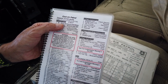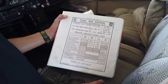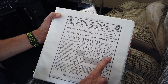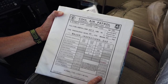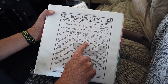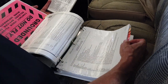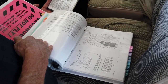AIF — the airplane information file — review and inspect for airworthiness. That's this big book. No matter where you fly, there's going to be a book that shows the maintenance status of the airplane. These are the required inspections, the dates when they were done, the hours, and when it's next due. This airplane is good — it's the end of July 2020 and nothing is coming due for quite a while. There's a 100-hour inspection and a mid-cycle oil change at the 50-hour point. I would go through this book — there are tabs for when maintenance was done, weight and balance info, and charts.